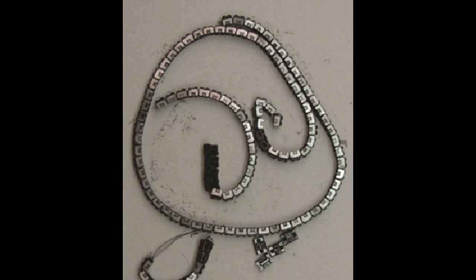This is obviously a broken chain. It came from the Computer History Museum on the West Coast. We were asked to see if we could somehow come up with a plan to rebuild the band into a workable chain. As you can see, this one is one major chunk with at least two side pieces and a few type down at the bottom. If you look real closely at the bottom left chunk, you can see broken wires stringing out. That's the wires wound together to make a flat cable that all the type are clamped to, as we discussed before. Obviously this one has been used, full of ink, debris, and so forth. Dirty, as they would say.